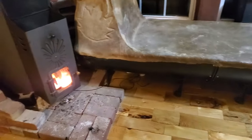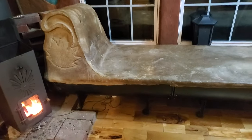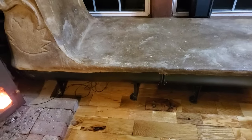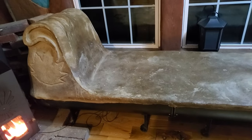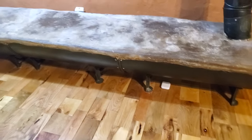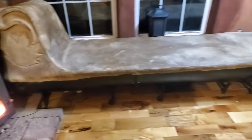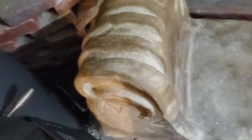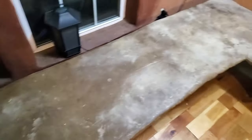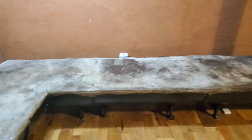So far we haven't gone over about 126 degrees, which is really great for keeping the floor from getting too hot. These barrels are sitting on cast iron legs from an old-style barrel stove kit. The pipe comes through the barrels — it's about 18 feet of pipe before it goes up and out of the house.